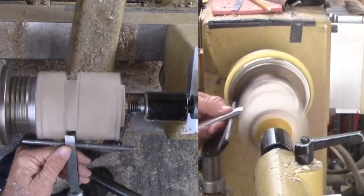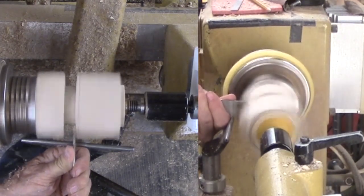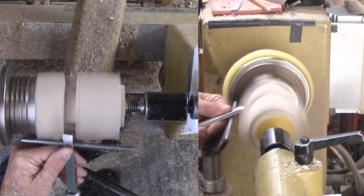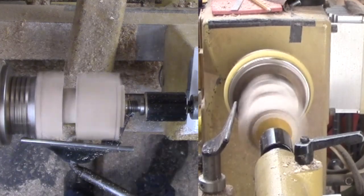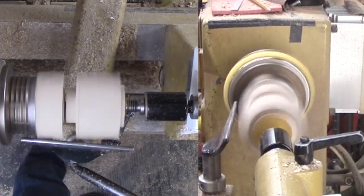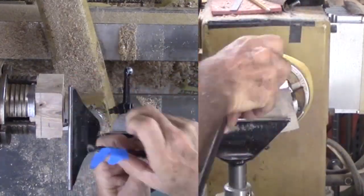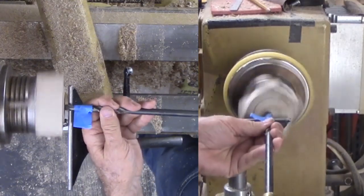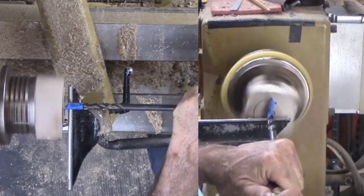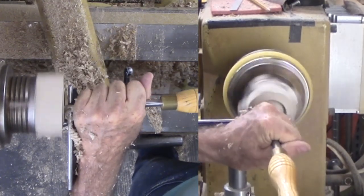This leaves a trace of wood just larger than what will be the tenon — no measuring required for the early rough fit. I saw the remaining small nub rather than risk binding. After drilling a center hole with a hand drill, I hollow the lid portion with a spindle gouge to start. This is a quick way to remove a lot of wood as the cut goes nicely into side grain. Then I refine the hollow with a box scraper to get parallel sides and a clean corner.